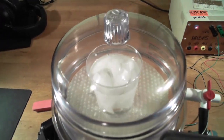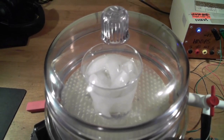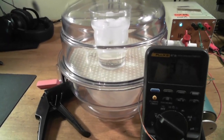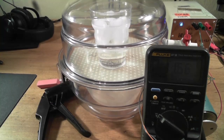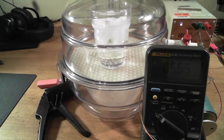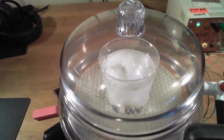I've actually got some action going on at the top of the glass — some bubbles forming there, but that's not water vapor. That is little gas bubbles escaping from the ice cubes and from the water itself. We're still railed out at 13.7 volts. Okay, final draw down. We're at 11 volts, still above full scale — 10. Now about 5 millimeters of mercury. I think we can pretty much call that boiling at this point.